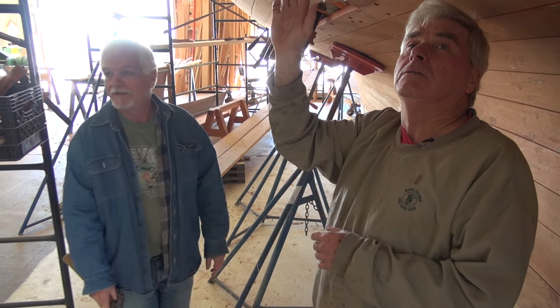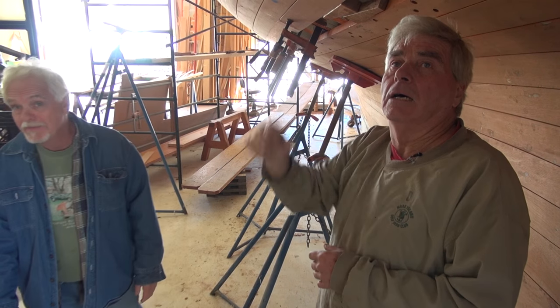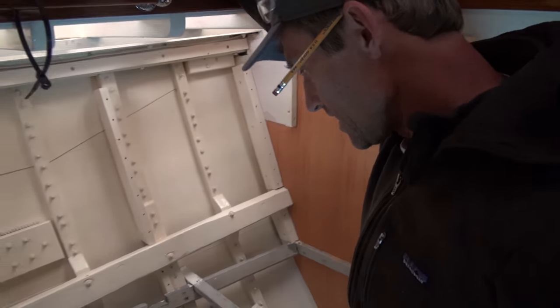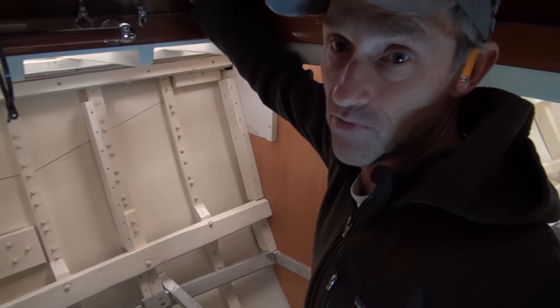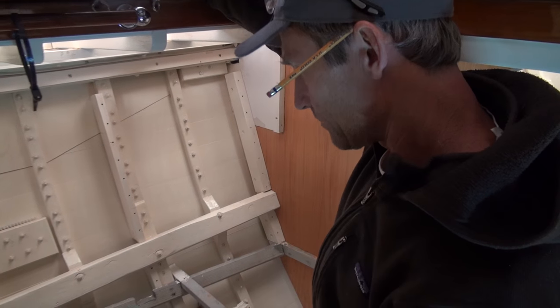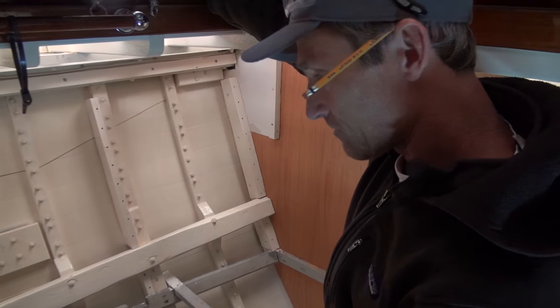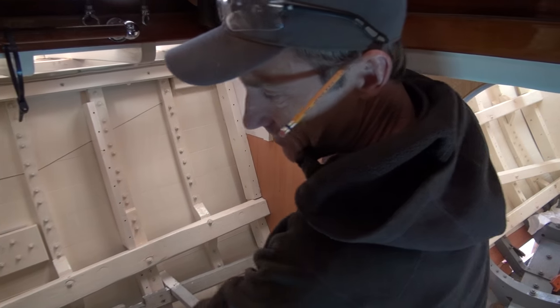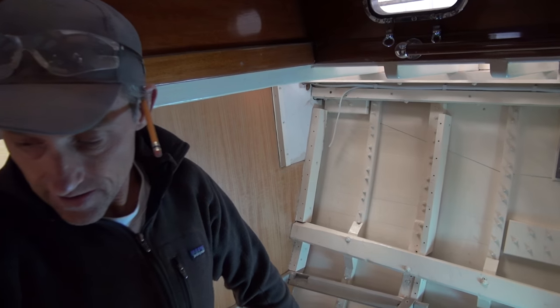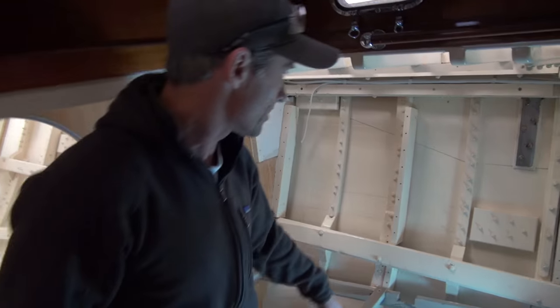John, lunch? Yeah. So what do we have? We've got about seven, seven-plus courses here down to the new plank we're installing right now, and everything had a primer coat on it before we installed the planks. They have one primer coat on them. And we get another primer coat on everything once it's installed, but we usually wait a few planks. There's about seven courses here, both sides. We got a primer coat on those the other day, and yesterday the first coat of Hatteras, which is a final coat.